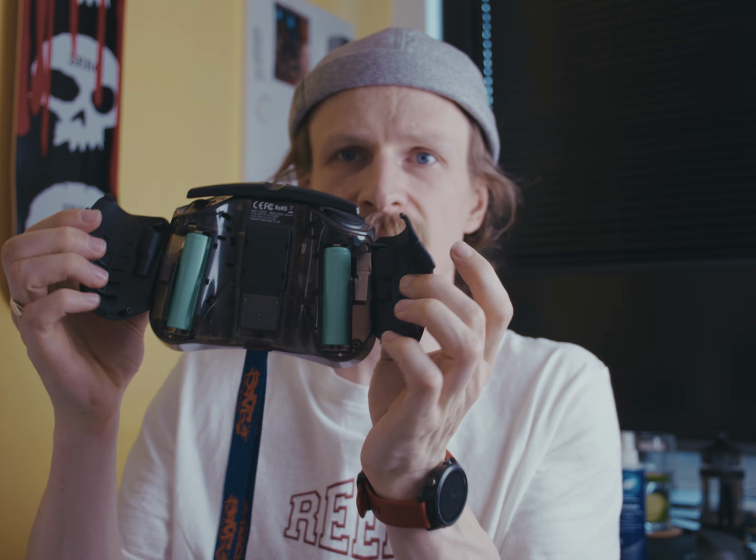So first things first with these controllers, you peel off the back, which is nice and easy to access. You're going to need a T8 screwdriver, hex head, whatever. Not this one actually, this one's wrong, but we'll ignore that. You're going to need a Phillips head screwdriver for the Hall gimbals. For some reason they are Phillips. To clean the heads of the Hall sensors I use cotton buds, and then you need some very important isopropanol cleaning fluid. This one's the AF IsoClean. So you spray that onto the end of the cotton bud and give it a little clean.